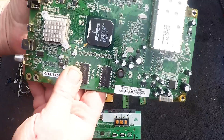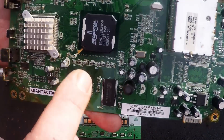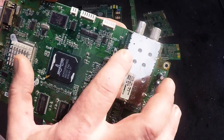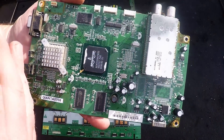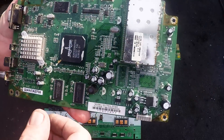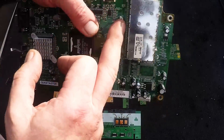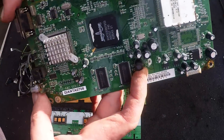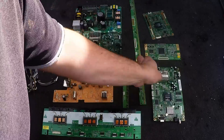The mid grade board — now technically it's a high grade board because it's got the gold corner chip, but it's only a mid grade board because it's got this other sort of junk on it. We can leave this and just sell it as a mid grade board, or you can depopulate it. If you cut this part off here, you can turn this part into a high grade board and this just into a power board — so it kind of balances out.